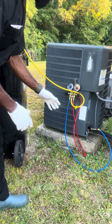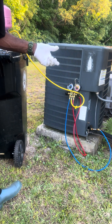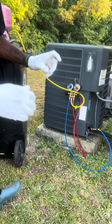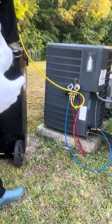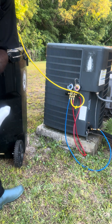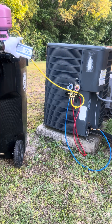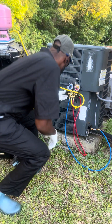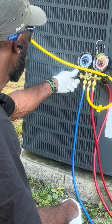What I'm doing right now is going up to about 130 psi on the low side, doing it in small increments — about one to two ounces per go. It's a slow process but it's the best way to do it. If you do it too fast you may run into problems. Keep watching your scale and watching your pounds drop. So you open that low side valve, get to about 130, close it, then repeat.